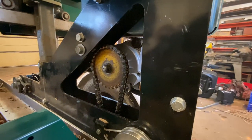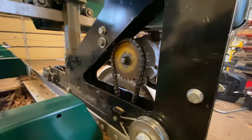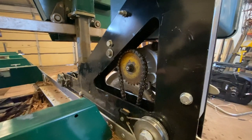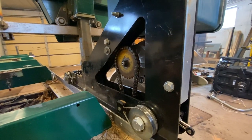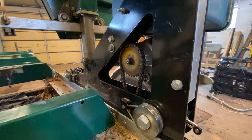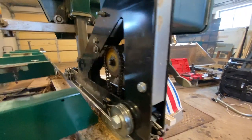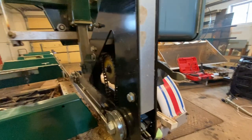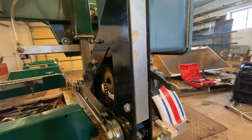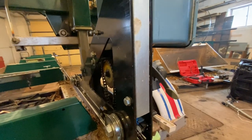One of the things I also like about it is I can still push this mill head manually up and down the track without power. There is some resistance, which is kind of nice when you're parking it — you don't have to put a parking brake or a block in the way. You don't have to worry about the wind grabbing it. If I do want to park this thing overnight, I left the parking brake on here — you cannot move that mill head. I don't need to put anything on here to keep it from going down the track with that parking brake on.